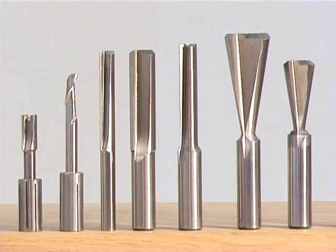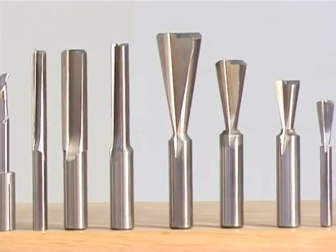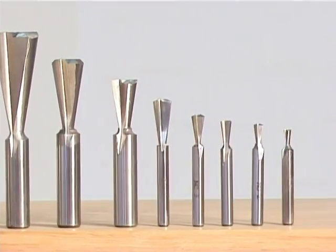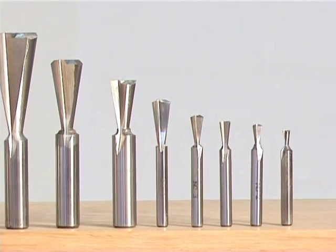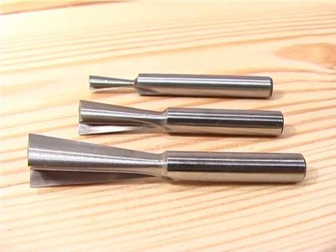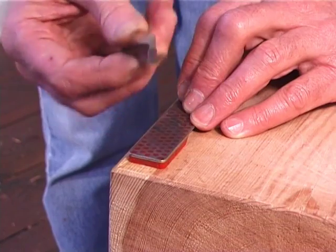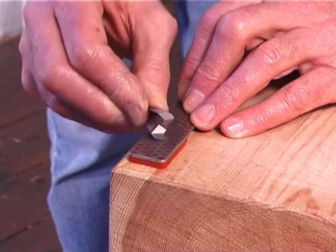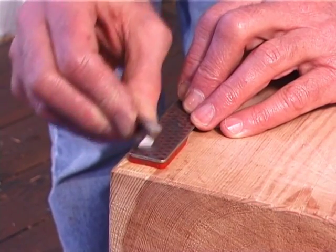You'll find that the only manufacturer making a full range of exactly graded cutters that come close to matching classic hand-cut dovetails is Woodrat. And we have special fine dovetail cutters for draw fronts too. Although high-speed steel bits may get dull, they are so easy to sharpen, it's like sharpening a pencil. Don't let me give you the wrong impression here. You will need tungsten tip cutters for cutting man-made boards, MDF, and some silicious hardwoods.